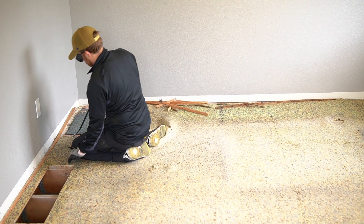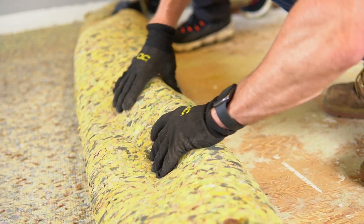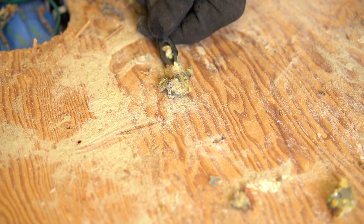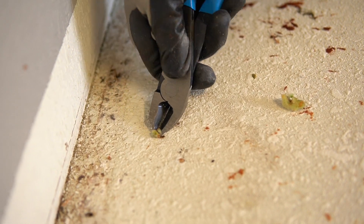The tack strips are fastened using a barbed nail, so a good pry bar can be especially helpful here. We rolled up the carpet padding and got to work on everyone's favorite part — staple removal. A cat's paw or curved jaw diagonal cutter like the 447 from Channel Lock are great tools for this job. Be thorough here to ensure your subfloor is smooth, even, and staple free.